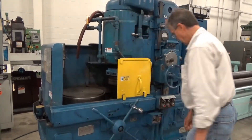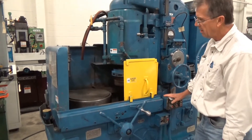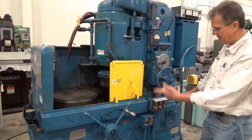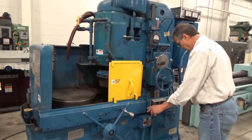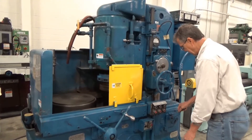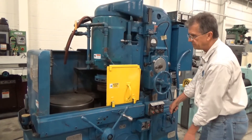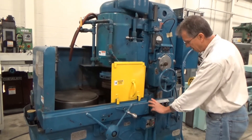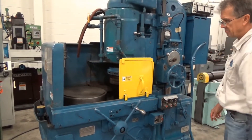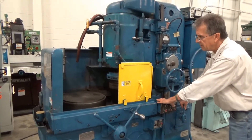Put the hand feed all the way out. We can do chuck rotation, of course. We're in 24 right now. That's the gearbox here — it's got four speeds. We'll go through all four of them and then back to 24. We'll go from 24 to 15. There's 15. Then from 15 up to 41. From 41 to 64. Moving right along. And then back to 24. There's 24.